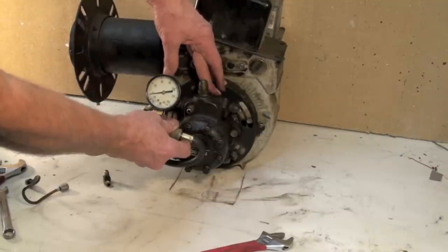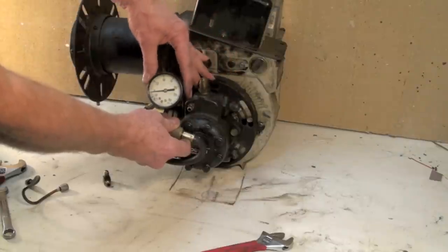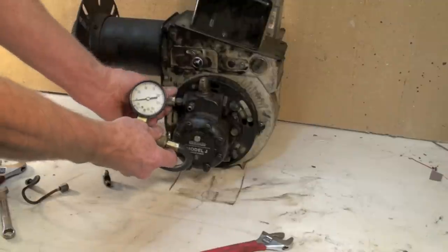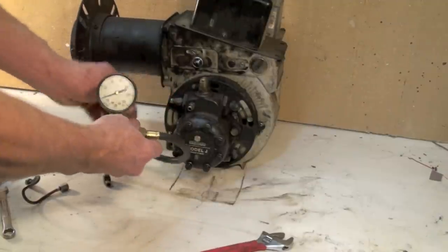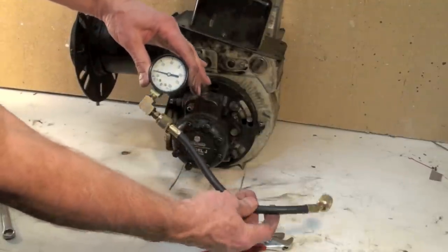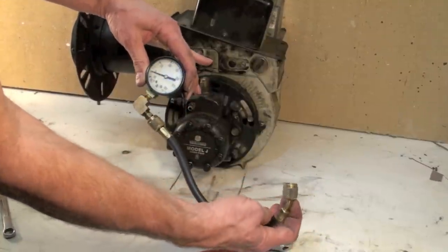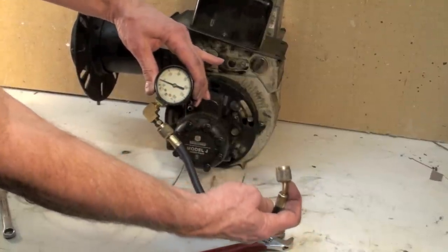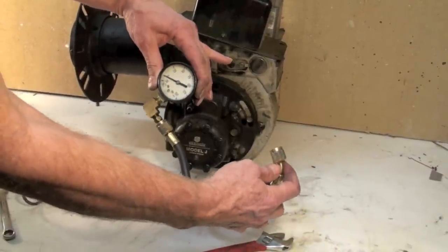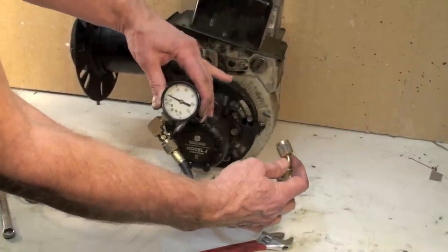If the regulator is failing, it usually ends up meaning a new pump. You can replace some of the regulator parts, but it's not really sure it's worth it. Now this little kit I have — this is a fairly simple thing bought from Johnstone Supply. It's an oil test kit with a short flexible quarter-inch line, very similar to what you'd find for refrigeration. You can actually use an old refrigeration hose if you'd like, though I wouldn't use one I planned to use again for refrigeration.